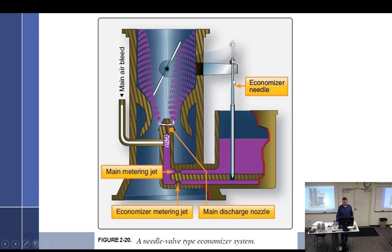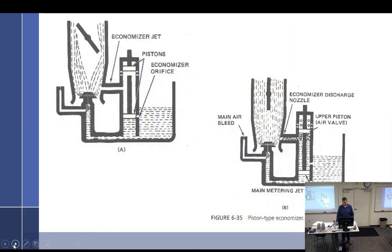So what you can see here is this needle is connected to this throttle. And when this throttle is opened, meaning we have more air flowing through, it is going to lift this needle out of its seat, and we now have two paths for fuel to go with two metering jets adding more fuel. So two passageways. And then when we go back to cruise, it's going to drop down in there and shut down this bottom one. And so we just have one passageway for just cruise settings. Simple? Simple. Very simple. And you can see that it's going to be adjustable for the right settings.